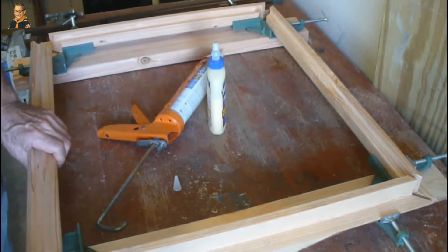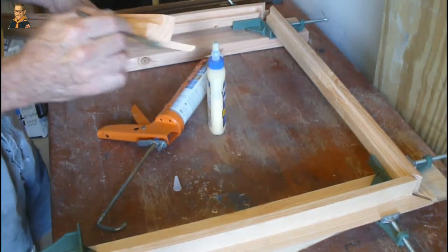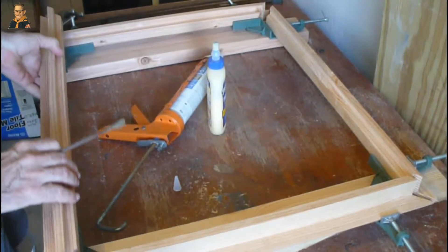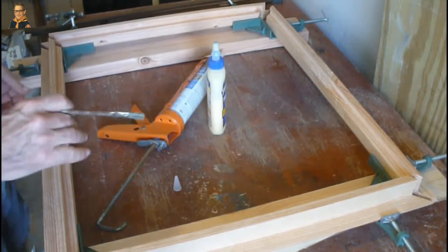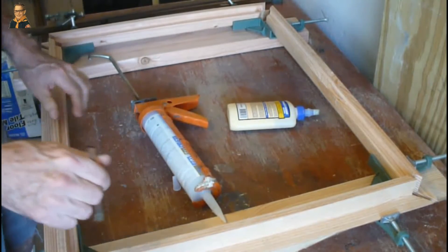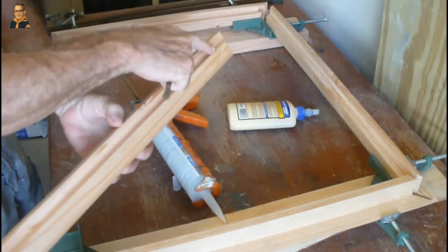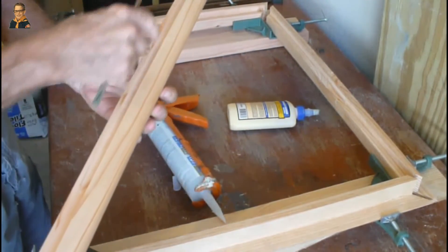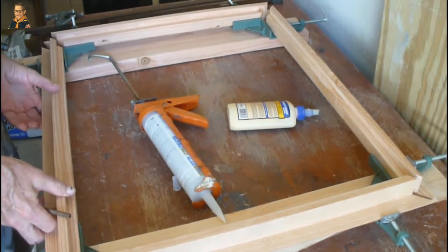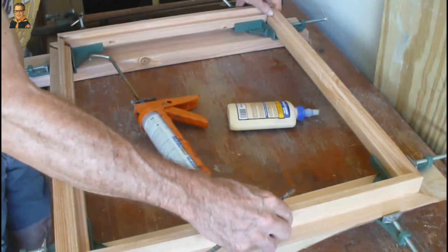I have some wood glue and I'm going to use this to apply that. I'll just paint the sides and paint the corners — take some wood glue and paint the corners like that, making sure it's nice and liberal on all eight corners. And then for the glass, the glue is going to get RTV. RTV will go along here and along here and along here. Then while everything is still wet, we'll push it together and then lay the glass in.